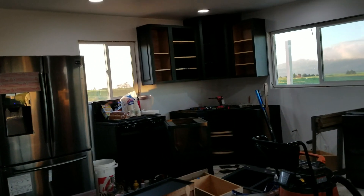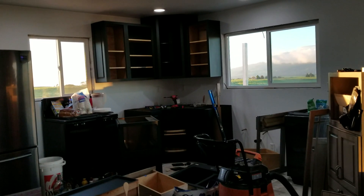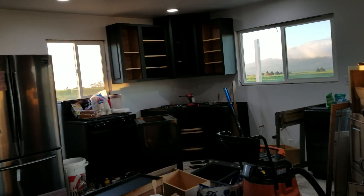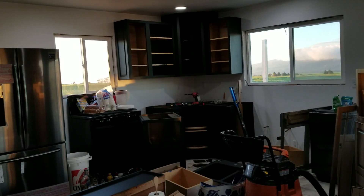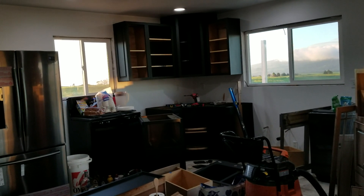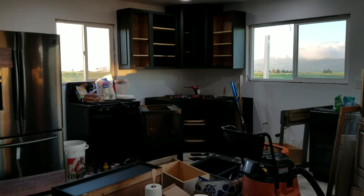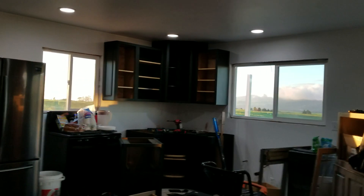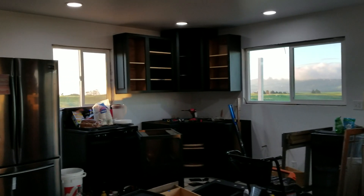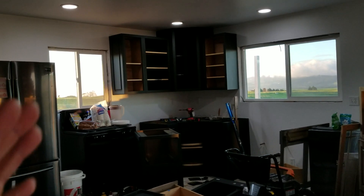I had my measuring cups and thought I was doing the same thing, but obviously I didn't compensate for all the extra thinning I did on that first test cabinet — that's what threw me off. Anyway, I'm going to remove everything and sand them all the way back down to the wood and repaint. Some may say just lightly sand and recoat, but if I'm going to redo it, I'll redo it the right way — heavier grit sandpaper, power sander, make quick work of it. Then I'll make sure to thin and mix everything as a big batch.